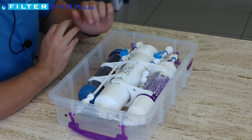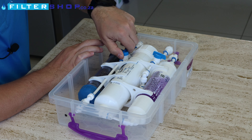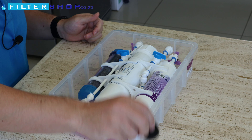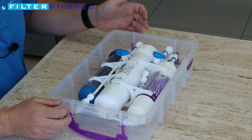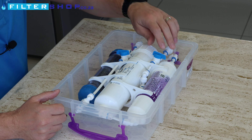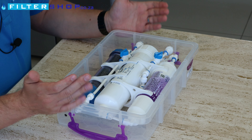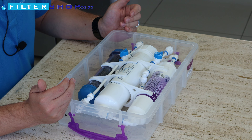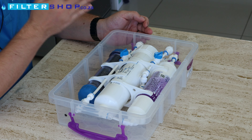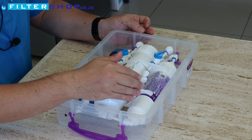The filters work as follows: first you go through a sediment filter to catch large dirt. Then you go through an advanced combined filter — first a KDF cartridge, which is carbon and KDF — you remove chlorine, catch organic molecules responsible for funny smells and taste. The KDF will also remove some heavy metals. Then you go through an ultrafiltration membrane, which is a physical barrier that stops bacteria. After that, we go through a color-changing mixed bed resin cartridge.